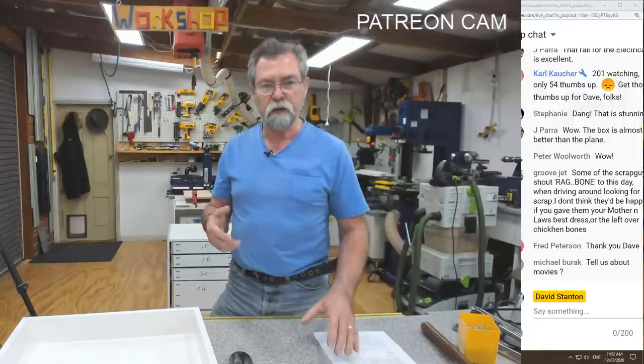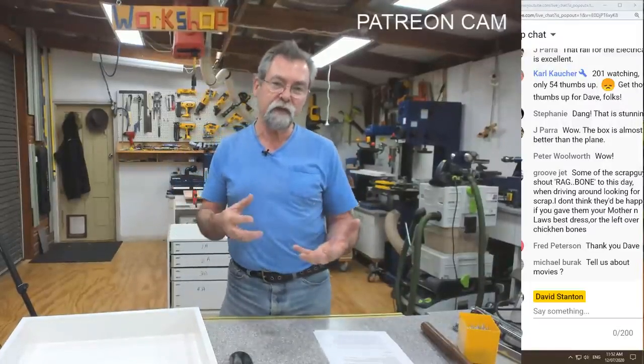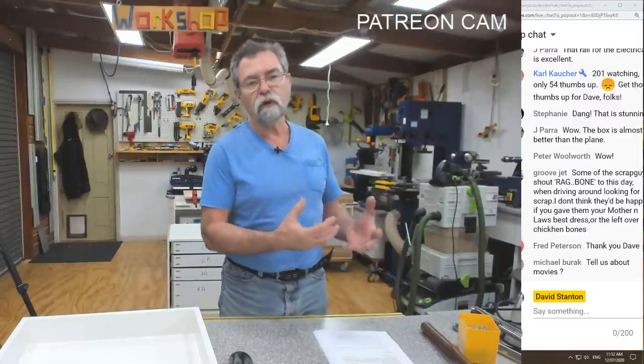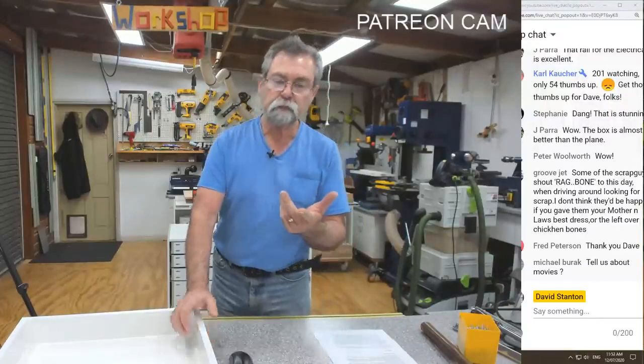Now, if you were to get one of those Amphibian 15 to 10 amp adapters, remember they're not a replacement for a 15 amp power point. It will just enable you to run a 15 amp if it doesn't draw more than 2400 watts. That's the story. You can get them from Bunnings or directly from Amphibian themselves on their website.